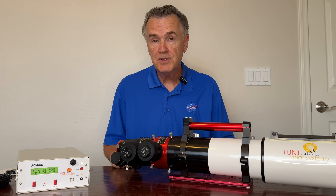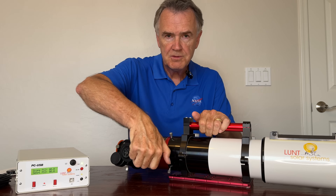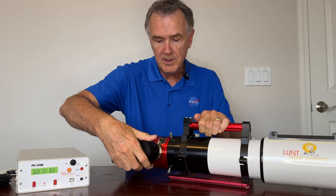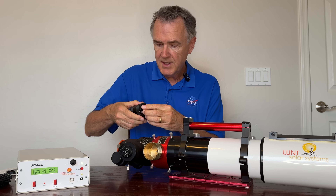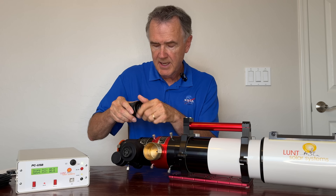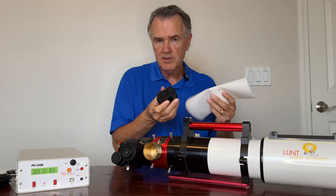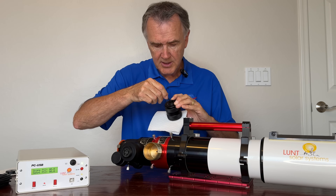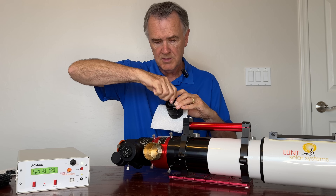To prepare your unit for use, you first have to replace the standard piston with the one that adapts to the air hose. I'm going to first remove the black handle. Here I happen to have a double stacked scope — I'm just going to do the air pressure adjustment on one. First I take off the original handle; there's the piston inside. Now I can undo a cap on the end, put that aside, and place a paper towel or tissue on the bottom to hold the piston secure. That way when I take the hex wrench and stick it in the hole, I can remove the screw without the piston rotating on me.